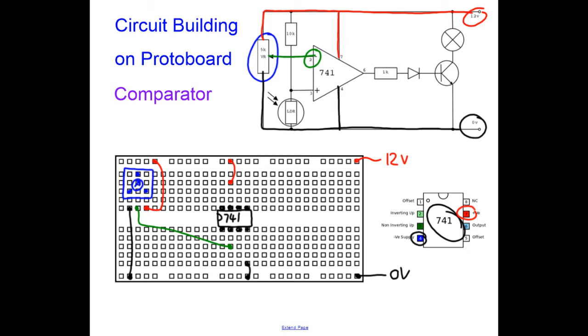The next thing is to add the 10K resistor and the LDR to form a potential divider. The 10K resistor starts up at the top — remember to leave a bit of space underneath to connect something else. The LDR is a little round device. The bottom of the LDR connects directly to 0V; the top of the LDR connects to the spare track. Use blue wire to connect the resistor to the LDR, then take that connection across to pin 3 on the op-amp.